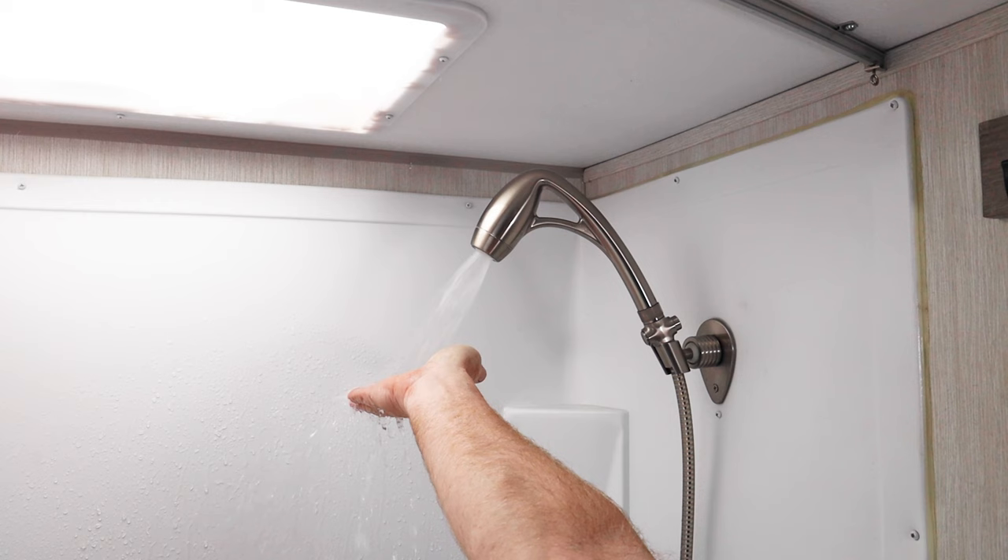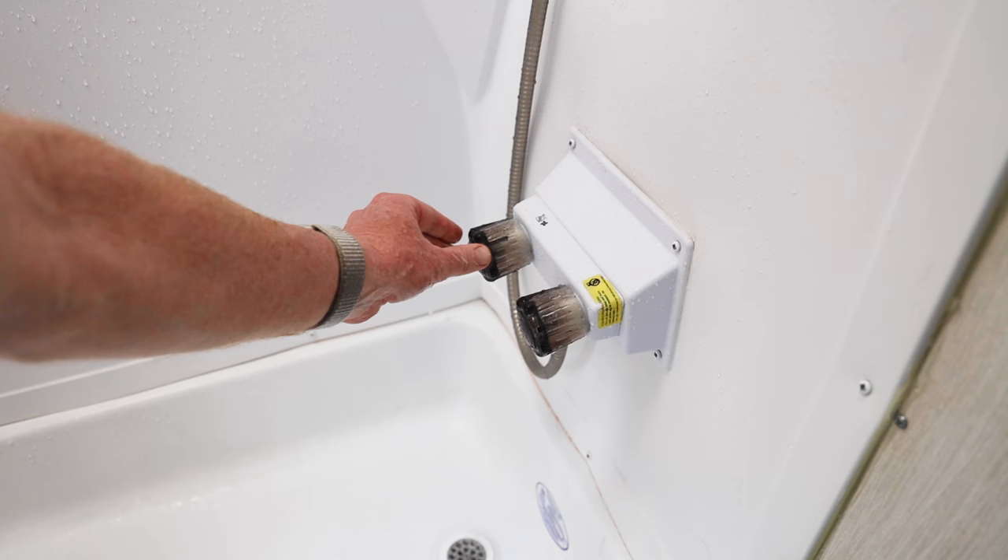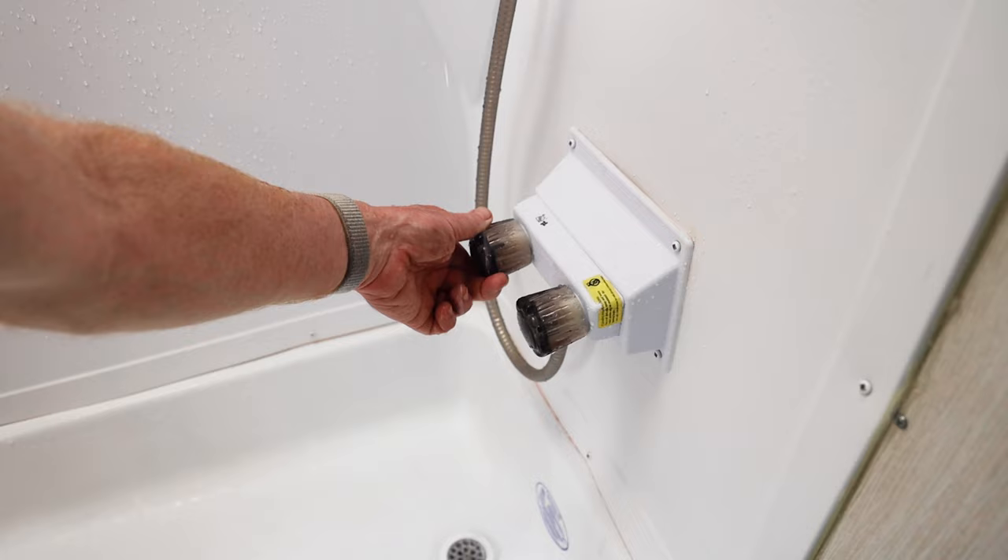So a funny story. I did some tests when I first put this in to make sure everything worked. I knew I needed to keep the water running to keep it hot, but I didn't remember to tell my wife how it all works. Because of that, she went to take a shower and turned the water on and off like she would with the original water heater. Every time she restarted the water, she would get cold water and start hollering that she can't get the soap out of her hair. I had to explain that the tankless water heater needs to keep the water running all the time for the flame to stay on and keep the water hot. That's how tankless water heaters work — they need to keep flow and pressure in order for the sensors to allow the flame to stay on.